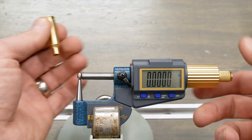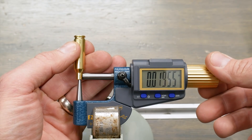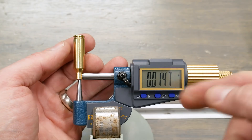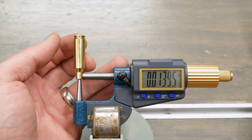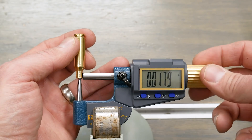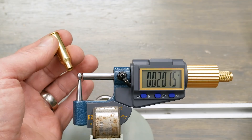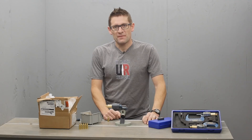To measure a piece of brass, we simply open up the anvil and then close it against the ball and take a reading. Reading: 14.5. Rotated about 90 degrees: 14.7. Rotated about 90 degrees: 13.9 — a little bit off center there. And 14.5. You've got to read at the same exact spot. Very, very good consistency, and again we could plot this data to a device if we wanted to.